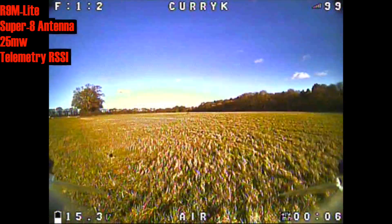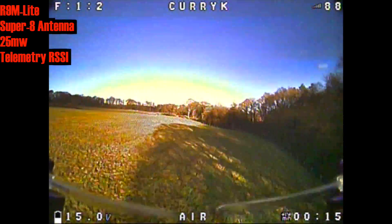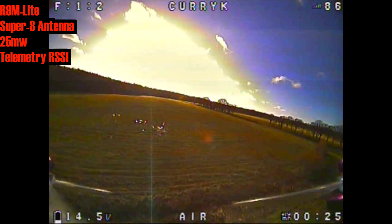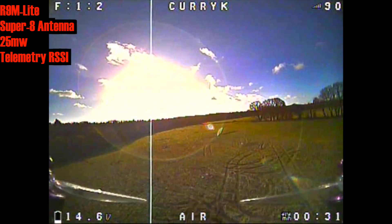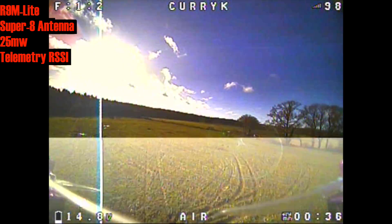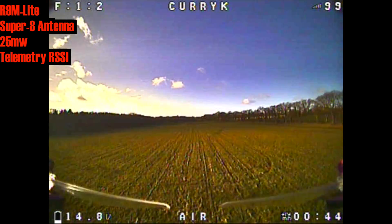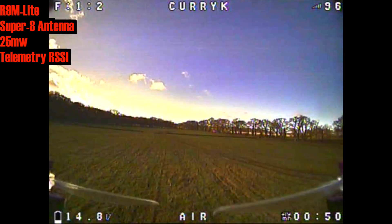Now using the X-Lite, doing exactly the same thing. The X-Lite module was always a little bit weaker than the normal R9M module and again we get a bit of a tail-off into the 80s, though it recovers. What I seem to be picking up from this is how critical the actual orientation of the antennas is as you fly. As you turn you create null points, and if you're slightly off that perfect line — remember we're only at 25 milliwatts — that can cause a big change. I find it interesting watching the worst-case scenarios.